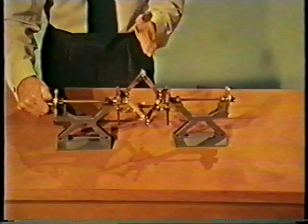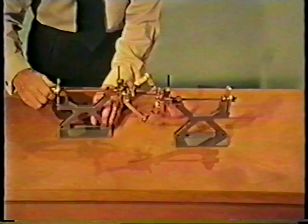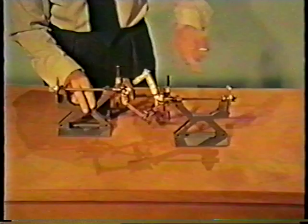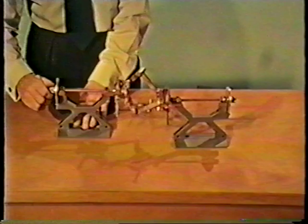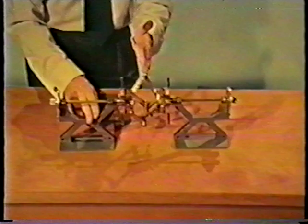When the shafts are in line, there's a plane of symmetry across the middle of the coupling. But two parallel shafts do not intersect, except at infinity. If then there is to be a plane of symmetry, and if this plane of symmetry has to pass through the point where the shafts intersect, any plane of symmetry in a parallel shaft coupling must somehow be imagined at infinity, not anywhere in the finitely accessible region. This, then, is the root of the trouble. When the shafts are in line, the coupling of itself cannot, as it were, distinguish between the plane of symmetry here, across the middle, and the other imagined plane of symmetry at infinity.